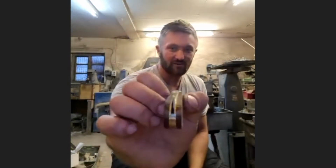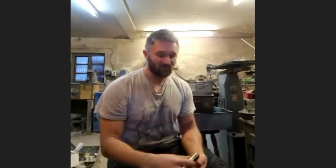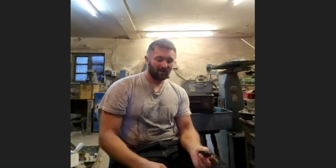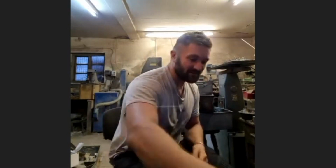But then, we've got this knife, for example, I don't know if it shows up or not, where the centering of the blade is obviously quite off. That's why this is up here, because it's one to expect. Quite a lot of the time, it isn't necessarily the blade itself that's bent. As you knock the knife up, you've got two pieces of essentially free-floating material, and your pin is trying to do this, because you're hitting it with hammers, so it's going to move. So part of the process of actually making them is unbending stuff.